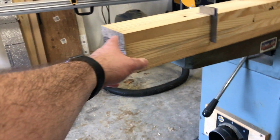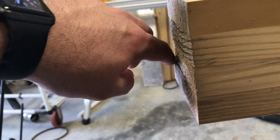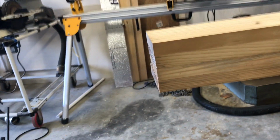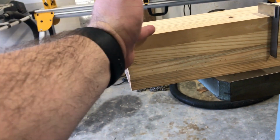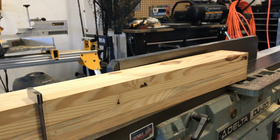So what I'm gonna do is cut, you can see right here, these aren't really even. On the end, I see this a little proud here. Some of them are under flush. So I'm gonna basically square this up against my saw, cut it orthogonal to the saw, get a nice square edge on this side, and then I'm gonna measure from this 26.5 down, and then cut the other end. Actually, I think I might start on that end because I kind of like that, and I don't want to cut too much of it off. I like that little detail there.